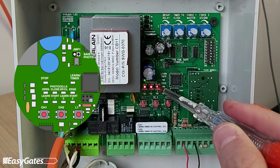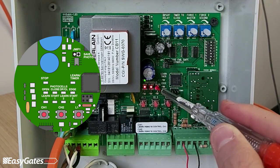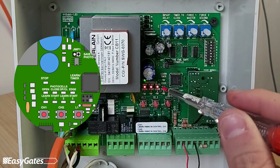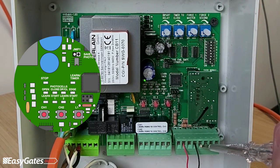The middle row of LEDs are for some of your safety inputs. The flashing LEDs are for the photocells, and the one on the furthest right is for the safety edge input. You'll notice there's a little resistor bridged across there which is monitoring an 8k2 ohm resistive input.